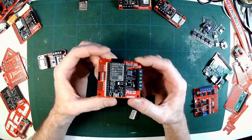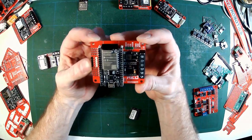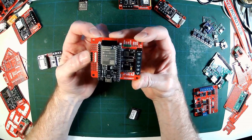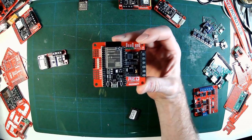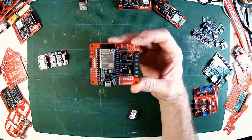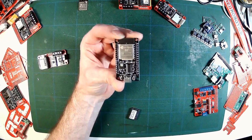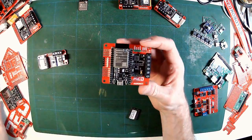Of course, these boards are a fair bit bigger and won't fit inside the footprint of a Pi Zero. So I decided to upsize to that of a Pi 3A+, which is still a good choice as it means they can be used with our original robot chassis. I had a 38-pin ESP32 dev kit in my parts box, so I designed a board around that. A bonus feature of this board is that it breaks out all the GPIO pins of the ESP32 module — on the side it's got another 14 I/O pins plus dedicated pins for serial and I2C communication. There are a lot of different sized ESP32 development boards out there with a confusing number of sizes and pinouts, so in the end I decided on the 30-pin dev kit, which you can buy in bulk packs on AliExpress. Here's my final design with the 30-pin ESP32 dev kit.